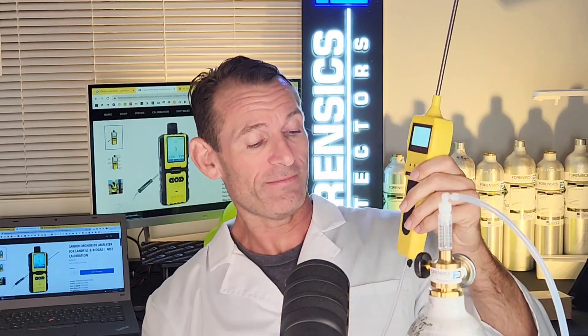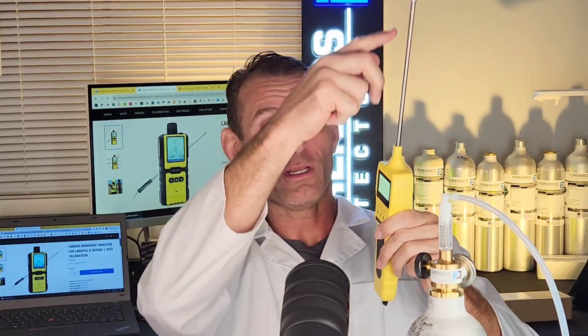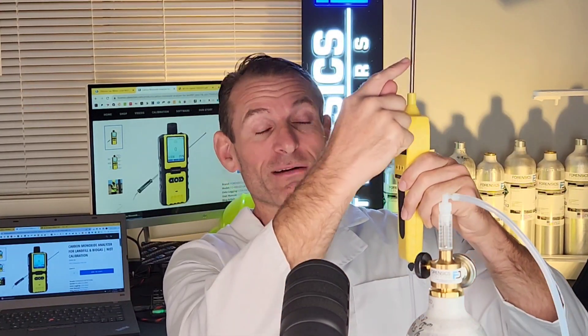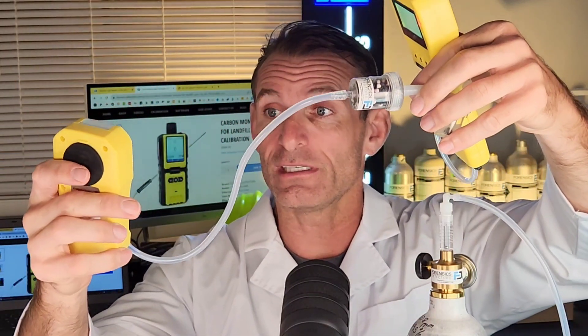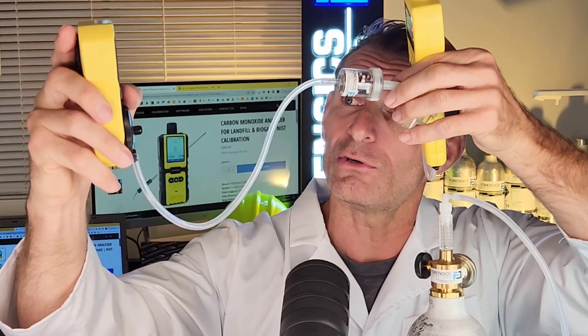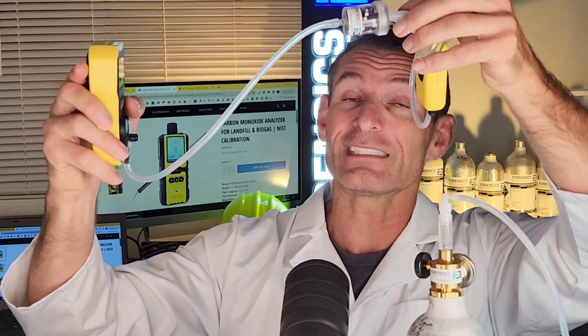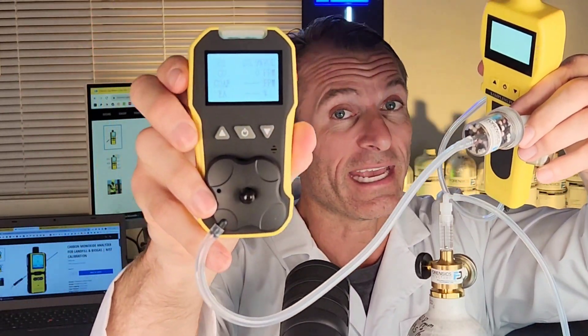This is the setup. We have a pump with the probe. You pop it into your combustion flue gas. The air travels through the pump, expelled at the bottom, through your water trap filter to take up any condensation, through your acidic gas filter to absorb any nitrogen oxides, through the last piece of tubing, and onto the gas detector, which detects oxygen and carbon monoxide. It then calculates the carbon monoxide air free and the EA, which stands for excess air.